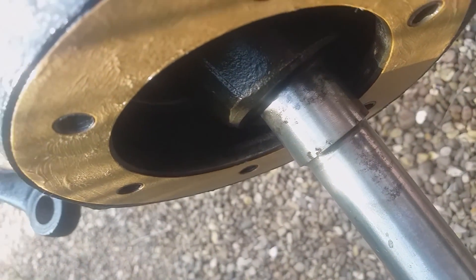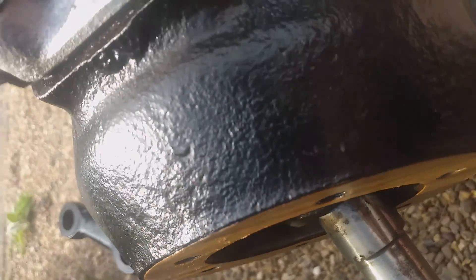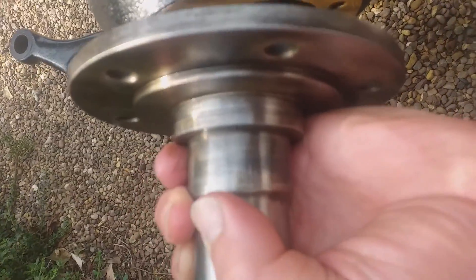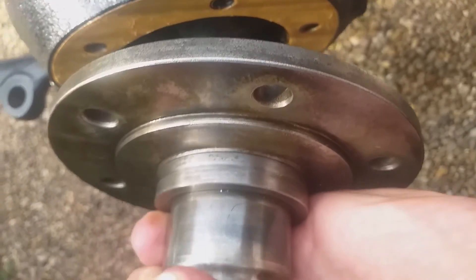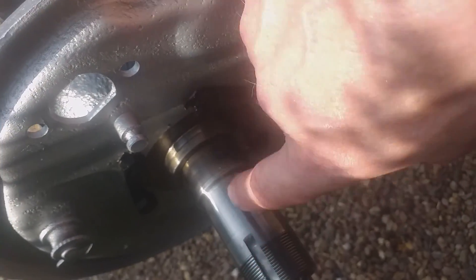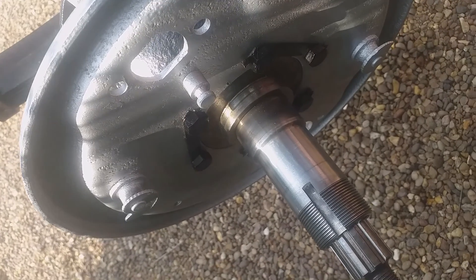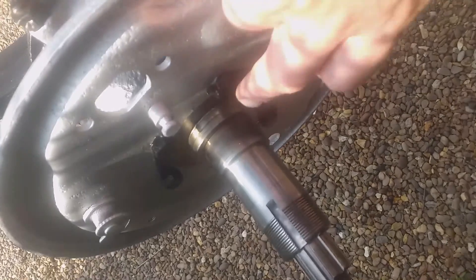My joint washer — or gasket as I always call it — is smeared with grease on both sides. This is the top of the swivel pin housing and the keyway on the stub axle wants to be parallel with that, so the keyway wants to be at the top. That will mean these two bolts will be together, so the keyway's at the top, the split at the top, and these wiggle-shaped ones are straight across the bottom — at least that's the picture from the workshop manual. It just remains for these to be tightened up. There's possibly no specific torque setting because they've got a lock washer, and where there's a lock washer you sometimes have to back off slightly so the lock washer fits in the right place.